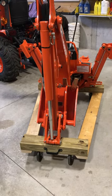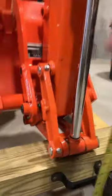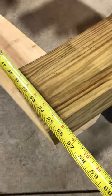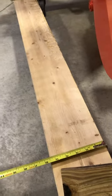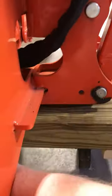We've got some 4 by 6 for our supports and some pretty decent-sized dollies. Overall height is nine and a quarter, overall length is 55 and a half. The two boards here are two by sixes — five and a half inches — and I just made it so there's room for the casters. The width on the back here is 26 inches, and 39 and a half at the long end.